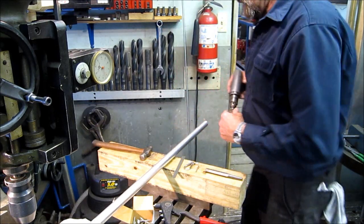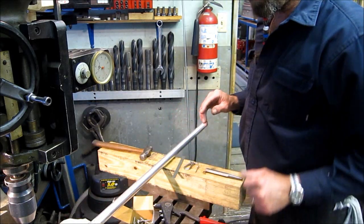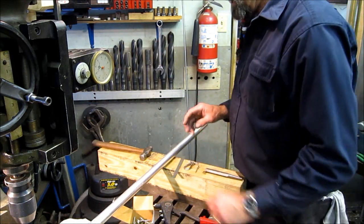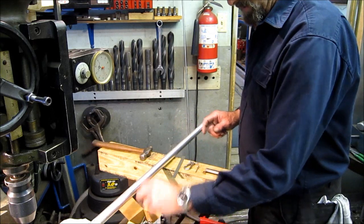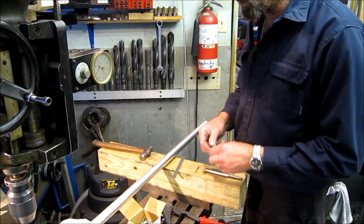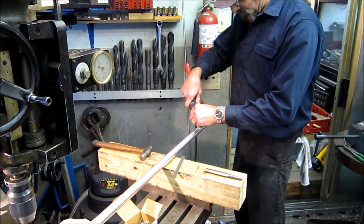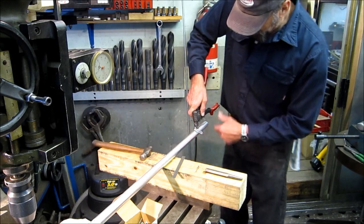Now the thing is that the 600 pounds of pull strength or shear strength on that pop rivet is if you're using the right rivet for the right thickness of material and the right hole size. Those are all important factors, okay? And they are all factored in on the right stick.